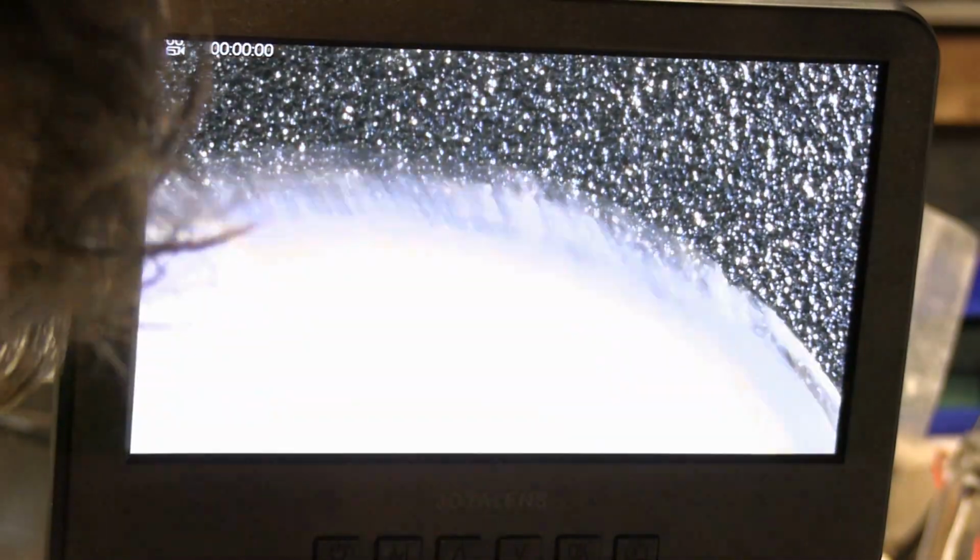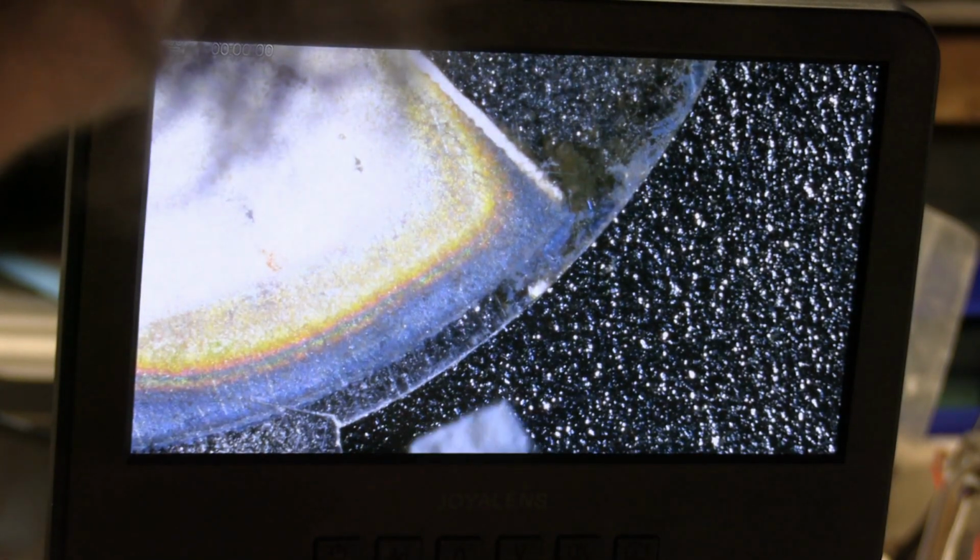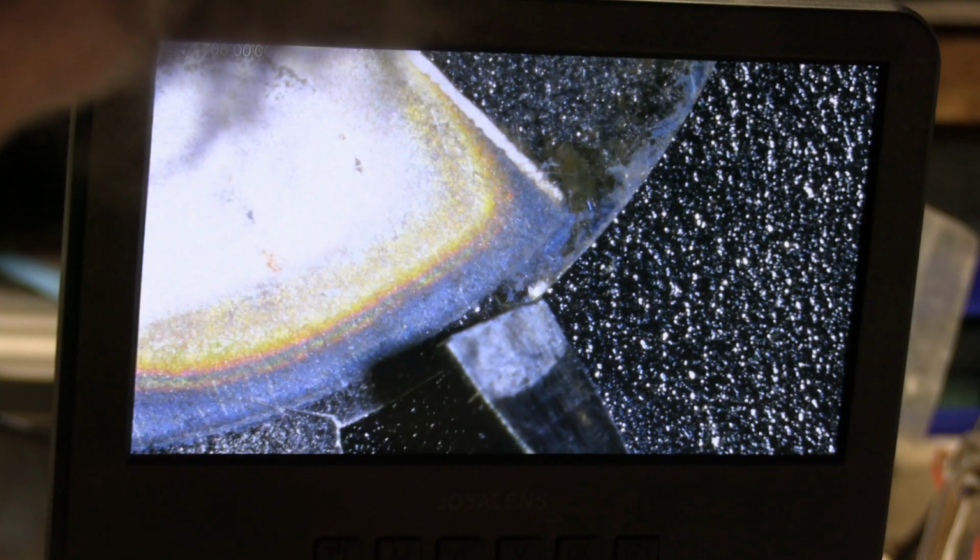And this blackened stuff here, that should just be clear. It should be clear mica, but that is silver that is migrated. It's drawn by DC voltage bias on the capacitor, and the silver ions start migrating. And they start shorting out, and you get that crackle. And there's another area where it's gone to the edge.